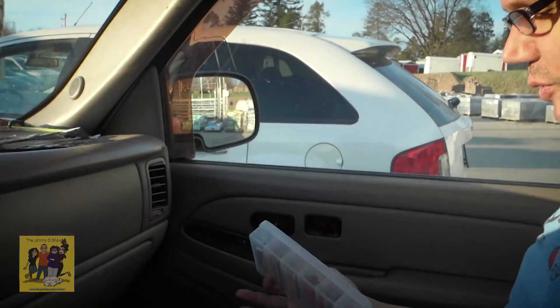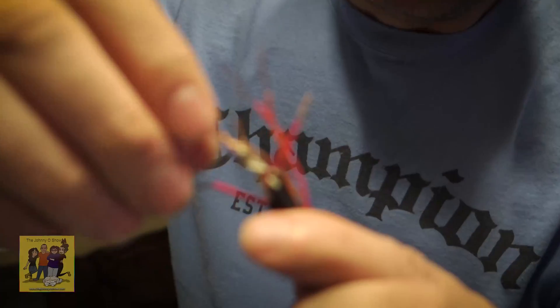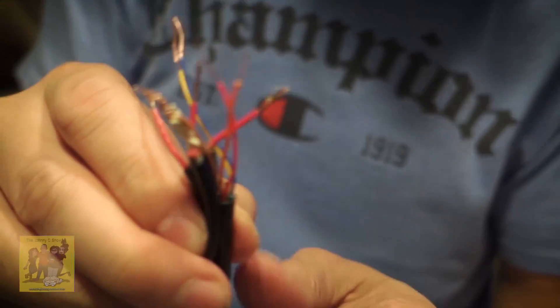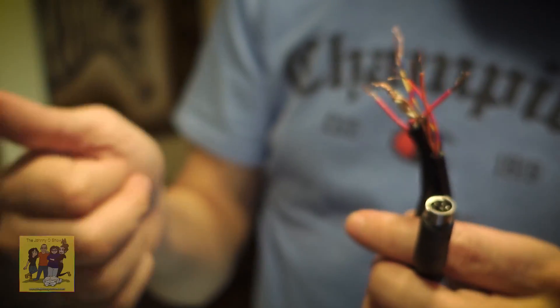Now we have the right tools to scavenge wire. I've got an old LG phone power cord that I'm cutting apart to get wire from — a little project box to bind everything together would probably be better. I took all the grounds and tied them together, using white as ground and twisting the brown DIN wire onto it. Then I'm connecting yellow, and each of the other colors to one of the leads, giving us four wires: 9600, push to talk, 1200, and data in.